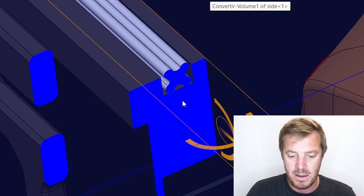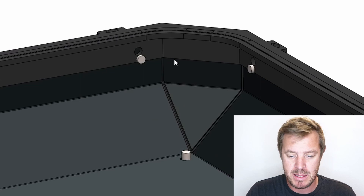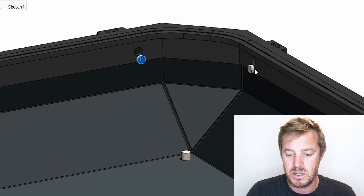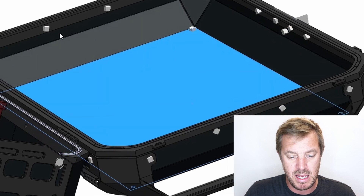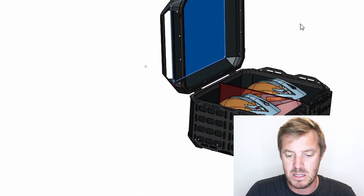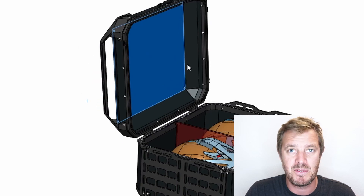We have to attach all the plastic parts to the metal parts — we're going to rivet them in place; rivets are very strong, and we'll also glue them. There will be quite a few parts to assemble and quite a bit of manual labor involved. One thing we're thinking about for the top box is a living hinge so the lid stays open at the top. However, I got feedback from people who've left lids open and had things fall out, so we're actually thinking the other way — where it tries to automatically close, almost pushing down all the time.